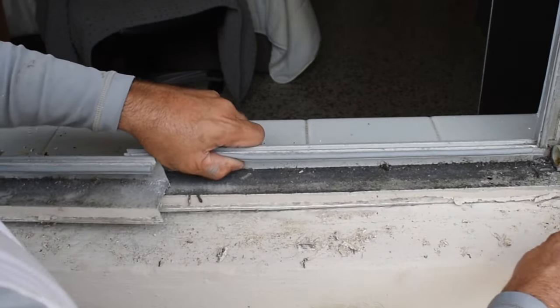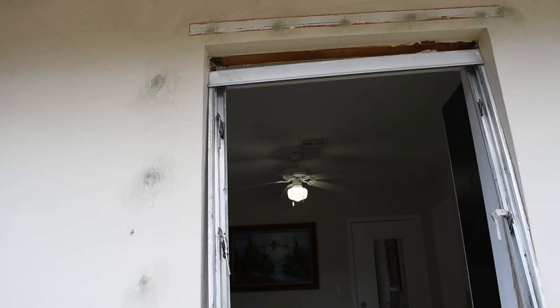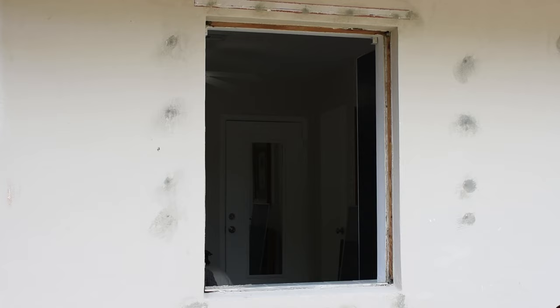Wiggle it, and this side came off easy. Tap on the right side again and the whole thing should come right out of the opening — easy as that. The pressure-treated 1x2s look pretty good. What I want to do next is clean around the perimeter of that opening, go on the inside, vacuum, and put up a plastic covering on the inside. What I decided to do for all the windows was go to the dollar store, buy an inexpensive shower curtain liner, and tape it on the inside of the wall, so when I do all my cutting with the concrete, none of the dust is going to find its way into the house.